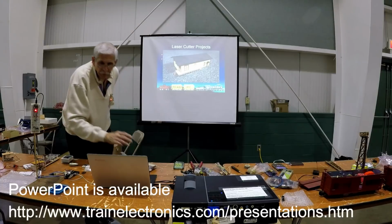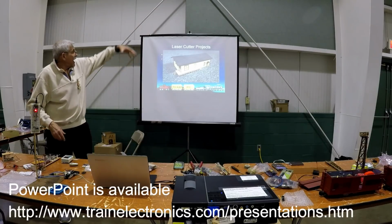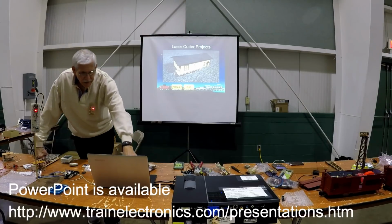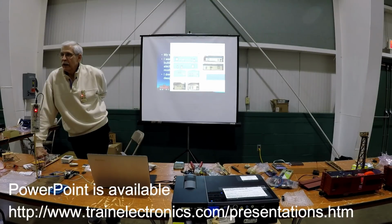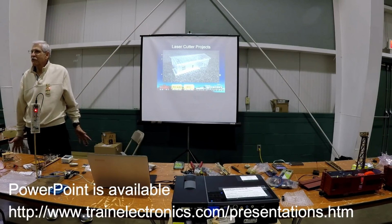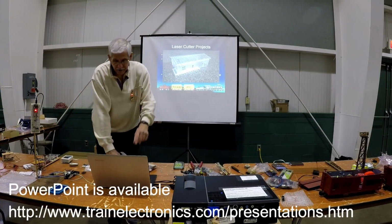My second building, I think I showed this last year. I don't transport it too much because it's fragile. I bought a laser cut station. This is HO, and it sits on my module and covers up a bunch of electronics. I wanted people to be able to see the electronics, but I wasn't crazy about them taking the building up and putting it back in the wrong place. So I designed that same building in CorelDRAW. That took a morning, about 4 hours of sitting at the computer. You can see the detail on there. But look what I was able to do. I made it out of acrylic, so now they don't have to lift the building up, they can see through it. And what if I want 6 of them? Or what if I want one bigger? If anybody wants the files, I think it's on my webpage.